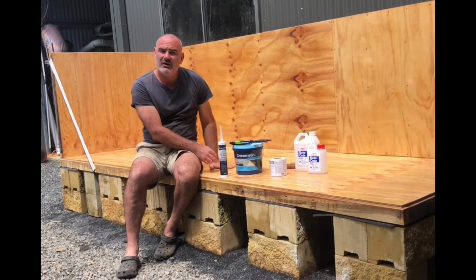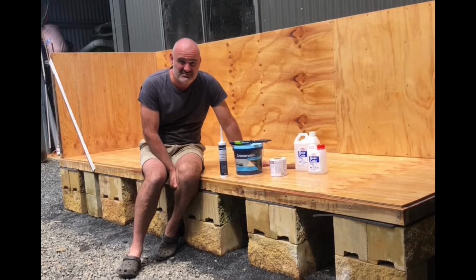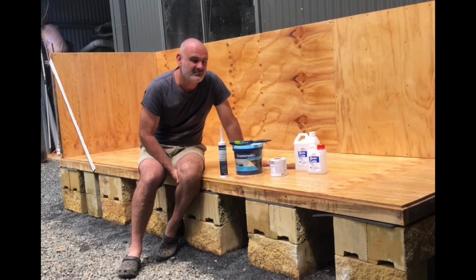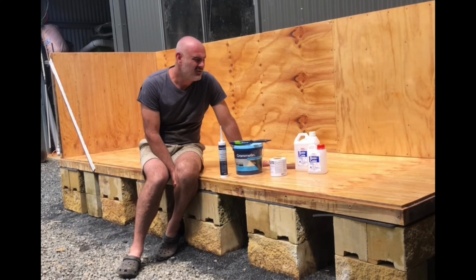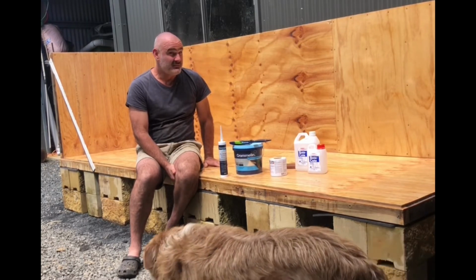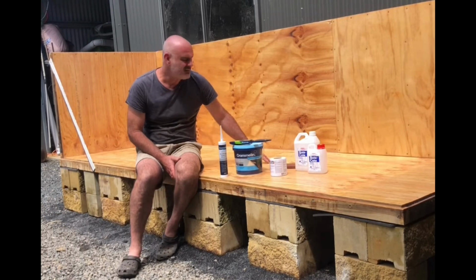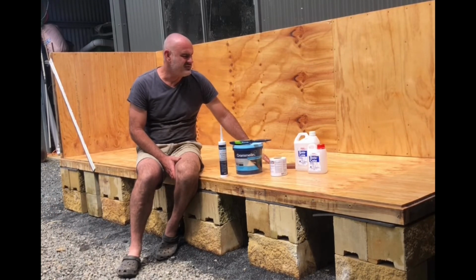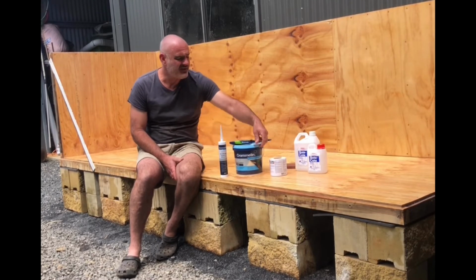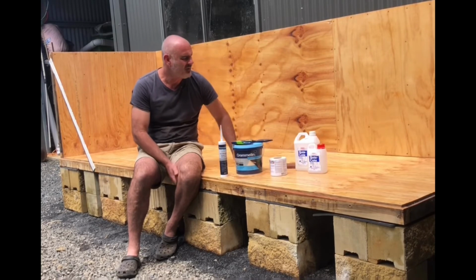First coat, I diluted a little bit with just a splash of methylated spirits. That's like a splash into 300ml of resin, a tiny amount. And that just allows it to sink into the timber a little bit better. And then I've used the subsequent coats neat, either with a brush or a roller, or in some cases just a spatula to screed it into the joins and whatnot.